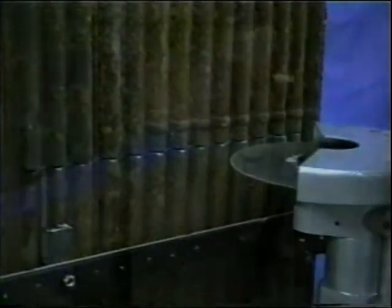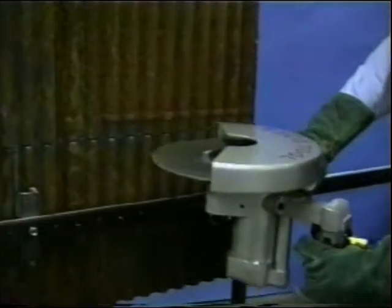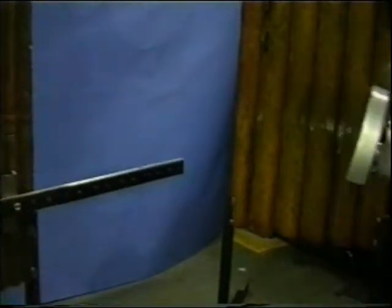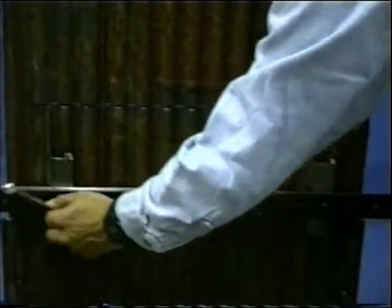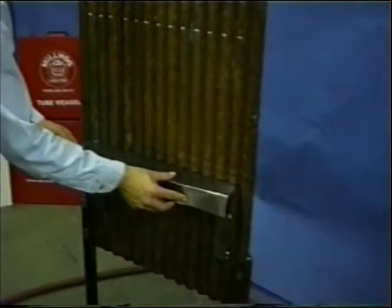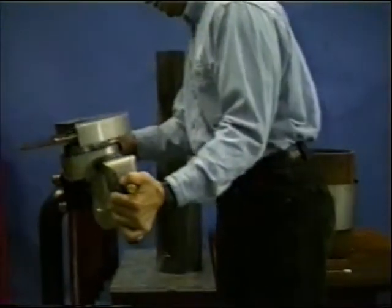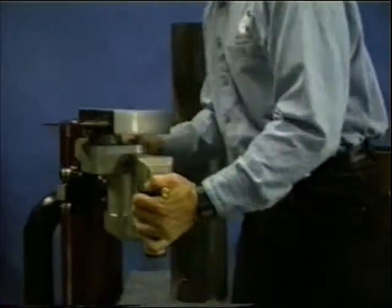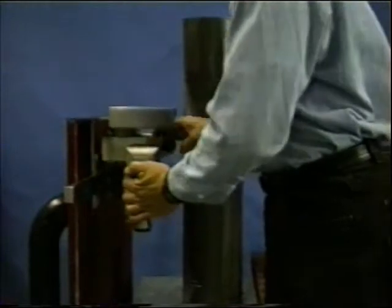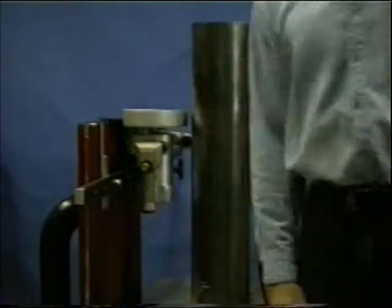When the bottom cut is finished, the air is disconnected, the saw is removed, and the track is unbolted and removed from the panel. Next, a piece of shim stock is slid into the bottom cut to help prevent slag and other debris from falling down the tubes. When cutting boiler tube panels with clearance problems, we have the APS-438LP low profile, which requires only 7.5 inches of clearance.